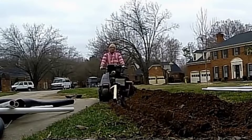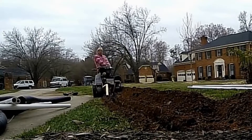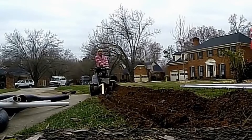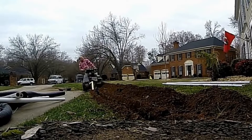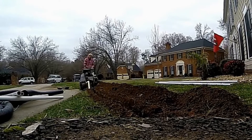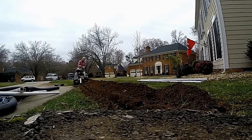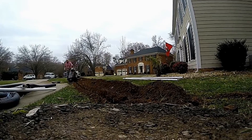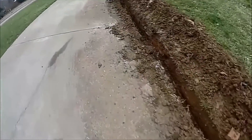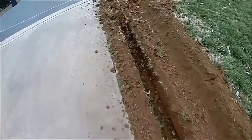If your driveway is tilted to one side, this system will work great. If it's really flat, you're going to need a channel drain — much more costly and much more involved. Remember, the best time to install is when the ground is dry, so frozen or semi-frozen ground. This is really a piece of cake with a trencher and makes a quick job of almost all your rainwater drainage installations. The trench I'm digging will double not only for the sump basin discharge but also for the collection from the catch basins.